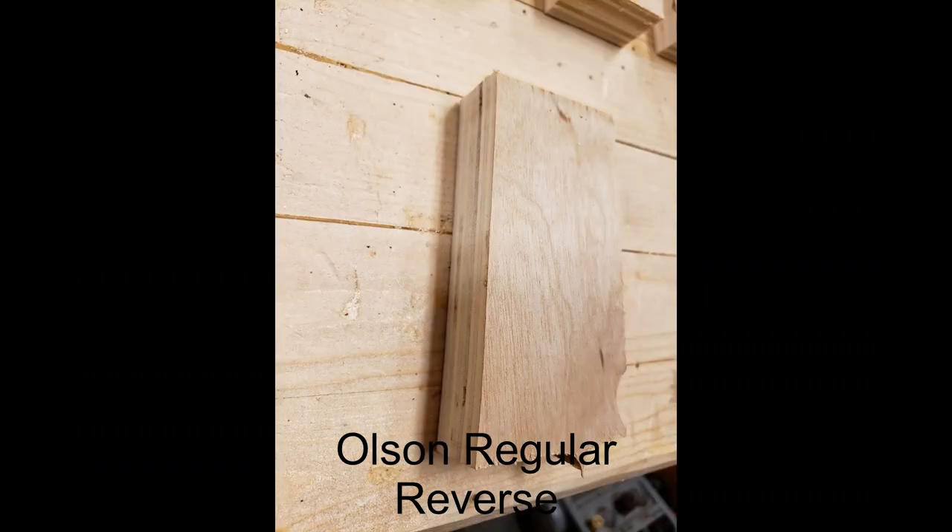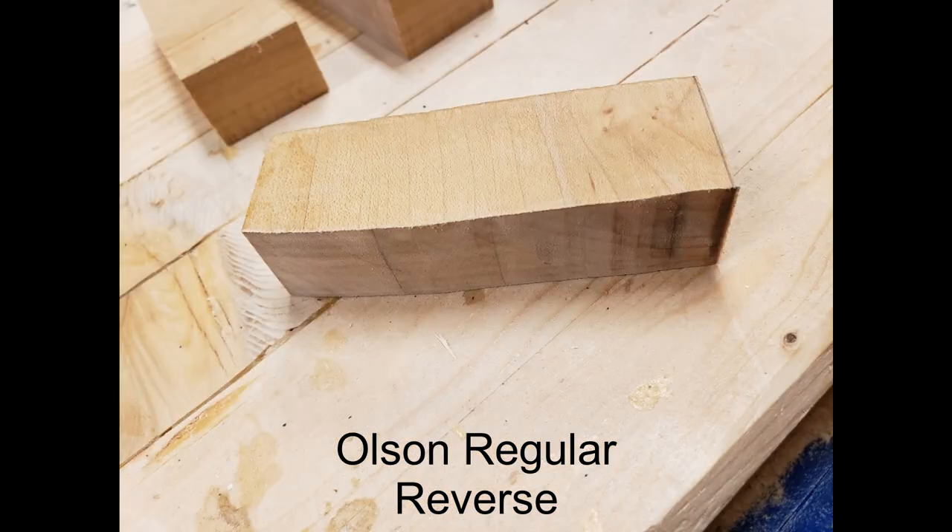You can see there's not a lot of sanding required, and it leaves a nice finish. The main reason I wouldn't want to use this blade is when cutting thicker hardwoods — it's going to leave scorch marks, especially in tight turns or any area where it can't clear the waste. There's not enough gullet space between the teeth, so you leave burn marks. They're not a big deal — you can sand them away — but if you're doing a lot of production or fine fretwork, it can be a challenge.